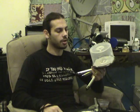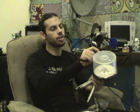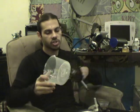So if you can get your hands on a 25-pack or such, great. Now, I have figured out a way to cut down the CD spindles. You take some masking tape, or painter's tape, and a mathematical compass, like I've been using in a lot of the antenna segments to measure the diameter and lengths of things in metric. You scribe a circle all the way around, and using a hacksaw or another tool, you cut it. But these tops are tapered, meaning it's a smaller diameter at the top than at the bottom. So if you cut this, it's not going to fit around the grooves of the CD spindle.